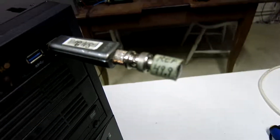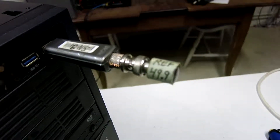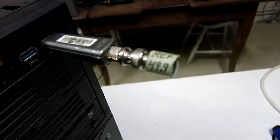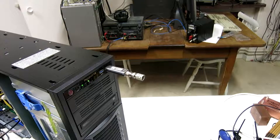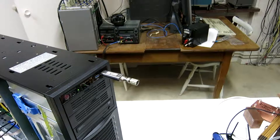Here is a 50-ohm termination — actually 49.9 ohms is my reference load, and that's the impedance on 144 MHz, but it's very close to 50 ohms. We know that the power coming out from that resistor is minus 174 dBm for each hertz of bandwidth.